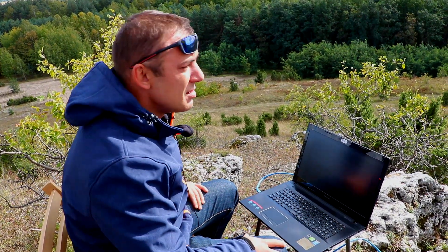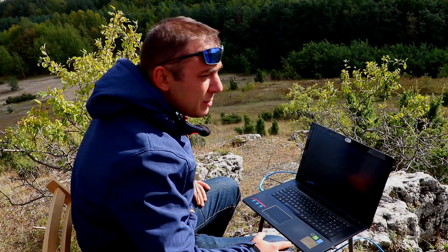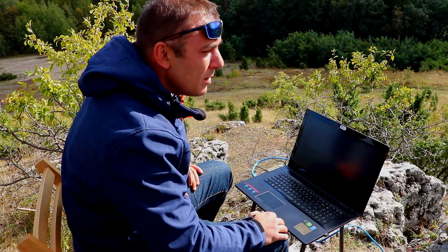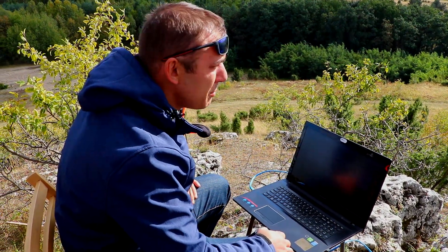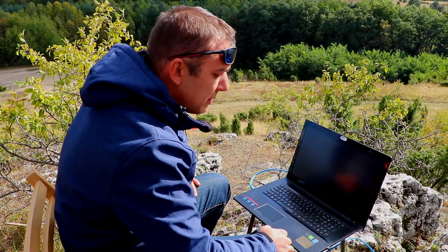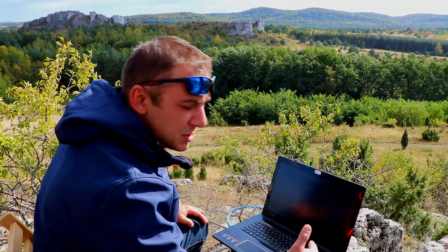We've already completed the tests using the built-in Ubiquiti tool. It was a bit windy, so the antenna drifted a little during those tests. Now we'll conduct tests using the Mikrotik bandwidth test. On one side we have the HPAC, on the other side the HEX-S — two capable units. This one has address 120, the other has 121. We're running in TCP and UDP protocols. Let's go.